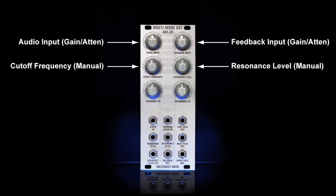Second on the right is the manual control for the resonance level. This will increase the resonance or the Q of the filter output. At zero resonance or with the control fully counterclockwise you get a nice clean filter sweep. Increasing the resonance level will eventually push the filter into self oscillation. The ADE20 has a nice fast resonance response right down to low frequencies which makes it great for highly dynamic passages and is great for creating filter kicks and subs.